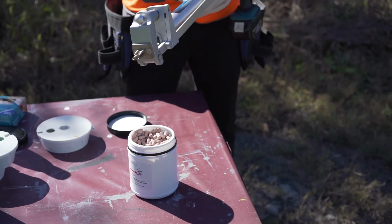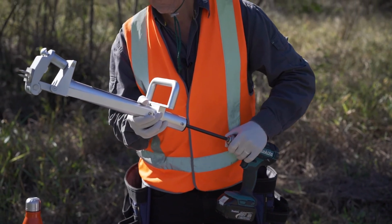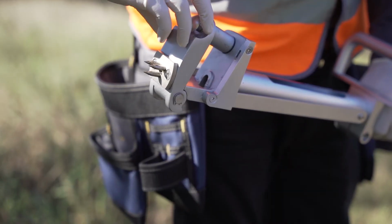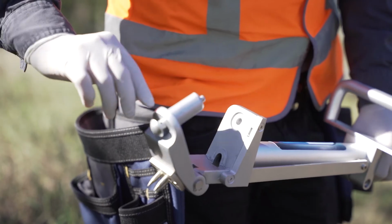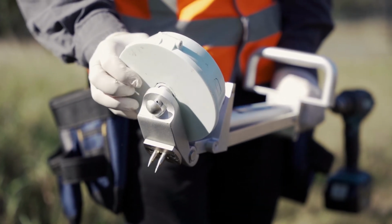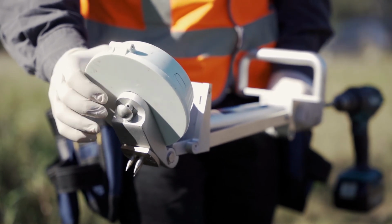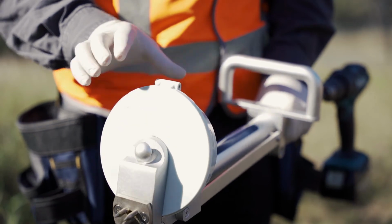Fully withdraw the drill bit to the rear position, otherwise the unit cannot be opened. Pull the knob at the front of the InJecta head to open the head mechanism. Place the loaded magazine unit onto the spindle with the lid facing forward and matching the location of risers with the cutouts. Close the front.